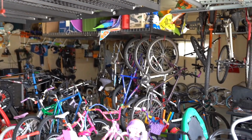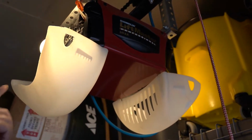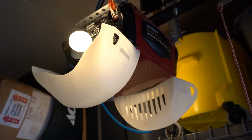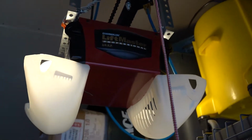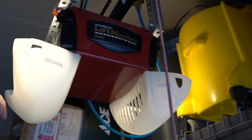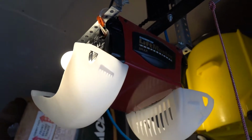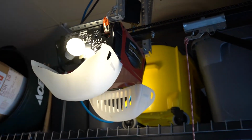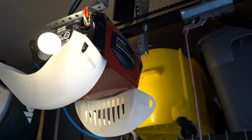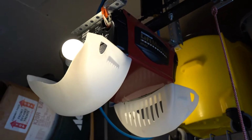Can you tell me what the symptoms were? Well, the garage door didn't open. It didn't seem like there was any power because the lights wouldn't turn on. There was power to the outlet because the light in the attic would go on. So figured it had to be somewhere in here. Checked the capacitors. Capacitors look good. Thought we would just try changing out the panel. And then you had seen online where they're switching out the panels and having success.